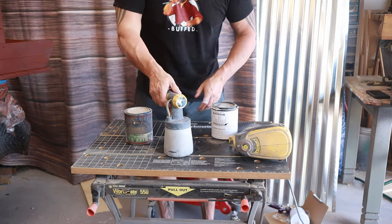We know this piece is going to be used at events — drinks on it, people against it, high traffic area — so I'm going to do two heavy coats of polyacrylic to give it protection. I go back and forth between semi-gloss and satin depending on the piece; this one I'm going to use semi-gloss because I want a little shine and it'll be easier to clean. With polyacrylic, whatever they normally use to clean furniture in their house will be fine on this — and it never has to be reapplied. Once it's on there, it's on there. I've heard people say this stuff yellows, but I have pieces five to six years old that have not started yellowing yet. We're not adding any water since this stuff is already thin.